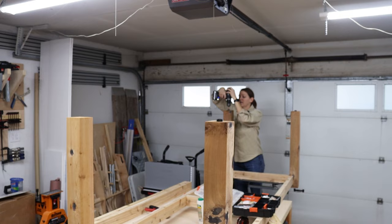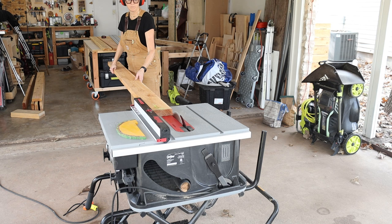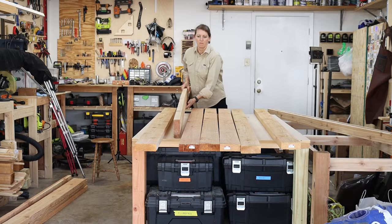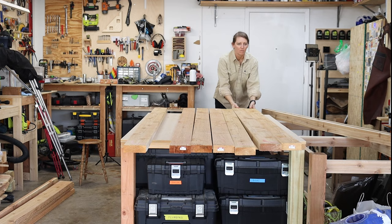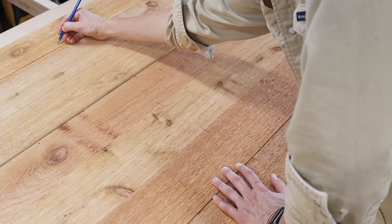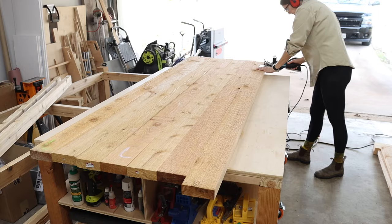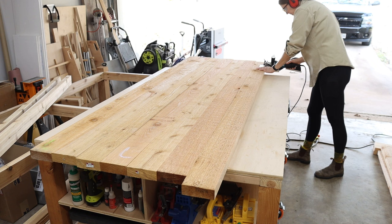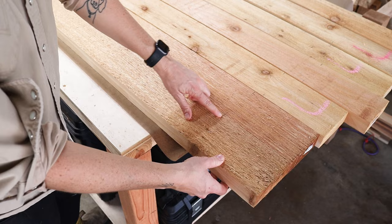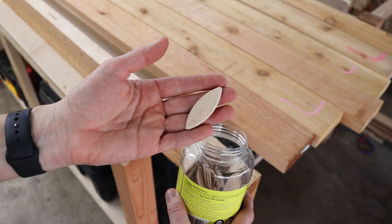The tabletop is going to be made from 2x6 cedar boards. The edges are super rough, so I used my table saw and just barely cut off the edge, leaving it smooth and straight. I laid them out making sure the nicest sides were facing up and the end grain was alternating directions to combat any twisting or warping in the future. I lined out marks across the seams to guide my biscuit joiner, which cuts slots in the mating edges to keep the boards aligned during glue-ups. If you don't have this tool, you could also use dowels. The two boards line up with slots and the oval-shaped wooden disc, or biscuit, slides in between them for alignment.